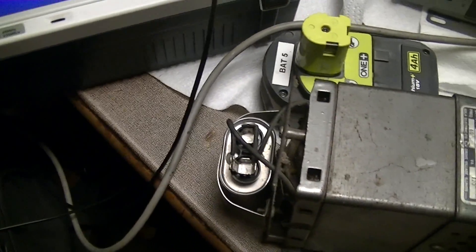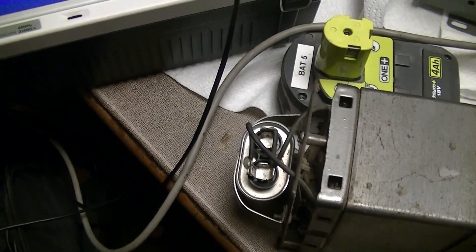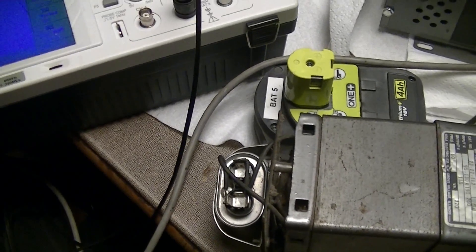They do make 1-kilovolt AC capacitors, and if I can find one that will fit I'll replace this with it, because 660 volts is the absolute maximum rating — and I have no margin headroom there given that the actual voltage across the cap is right at that level.